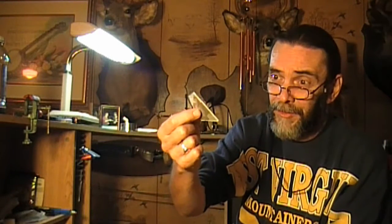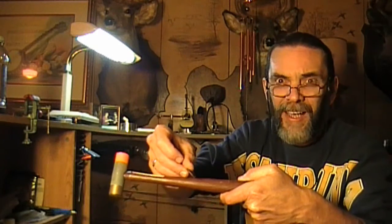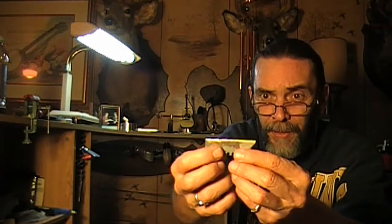Right now I'm going to bring you in closer and we're going to work on this crack a little bit. I've showed this before, but I'll show it again because a lot of new subscribers probably didn't see it. Take a razor blade — or in my case a utility knife blade — and there's a little vise up here. Lay that blade at an angle on a piece of steel and jerk it across at an angle several times. What that'll do is create a burr on the very edge of the blade. Then I've wrapped tape around both ends.